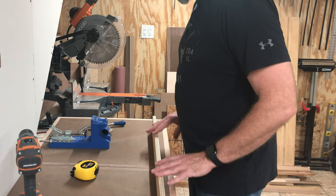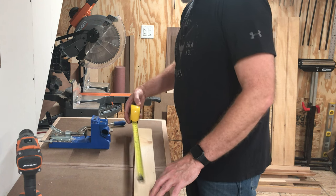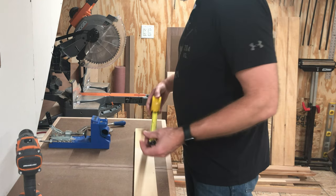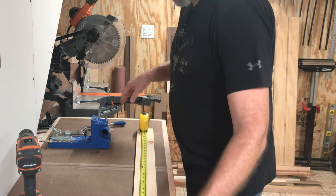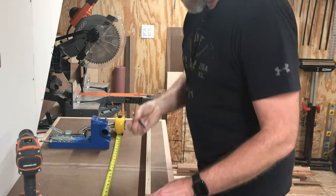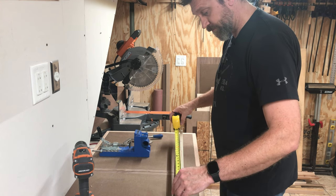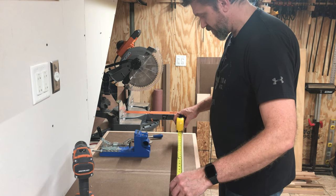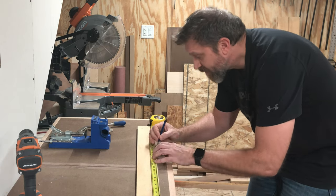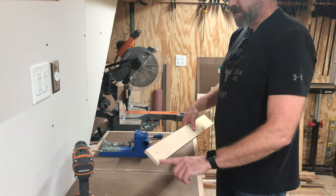As my friend Matt Outlaw says, pocket hole time. So we want to just divide this up evenly, maybe every 4 inches or so. This is 28 and a half inches wide and we'll probably go an inch from the end and then every 4 inches or so along the way. Mark that off on the top end so I can see it. These measurements aren't critical — I just want to get enough screws in there so it holds well. And then we're going to do two on the ends on each end.